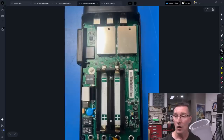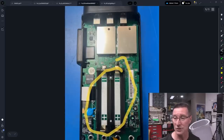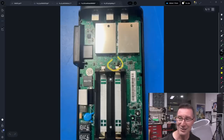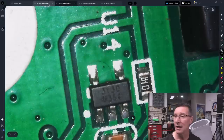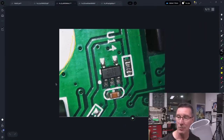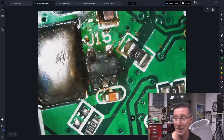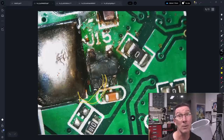Here's an overview of the entire board inside the oscilloscope. It looks like it uses two 18650 rechargeable batteries. You can see there's a possible burn mark — that's where the guts came from. And this is where the other identical one is, over here. You can see the trace coming down like that, so identical part here and here. An important clue in debugging problems like this is component location — it's connected through to the tab of this cell, and it's going in right there by the looks of it. Component placement is everything.